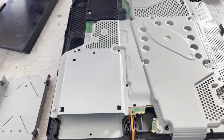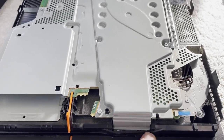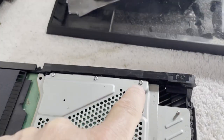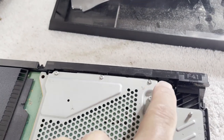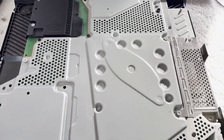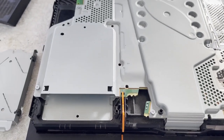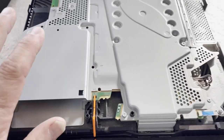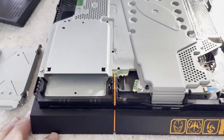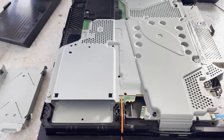I'm not sure what the original problem was with this, but it is missing a lot of screws. The screws that are in here, like up here, are the wrong ones — those should be little flathead screws. So somebody's been deep into it. All I'm going to do is put a hard drive in it. I believe these were 1TB in this particular special edition, so I will put a 1TB drive in it and see what other problems await us.